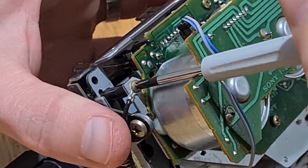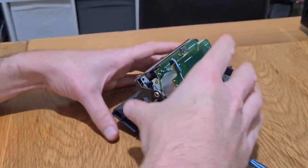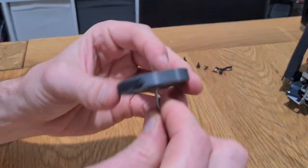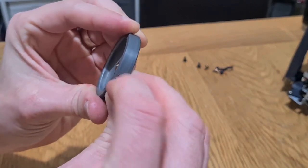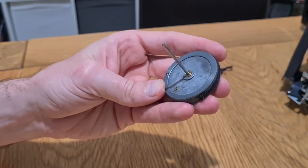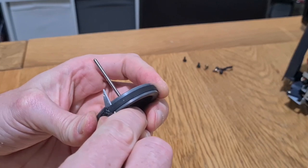So for the purposes of the small drive belt for the door, that's done. I didn't particularly need to do it — it was working — but if you have two belts in a set, why wouldn't you? Now we're looking at rebuilding the drive motor side. I need to remove this black gunk. The stuff on the capstan doesn't seem to have quite turned to cheese just yet, so there are a couple of ways of doing this.